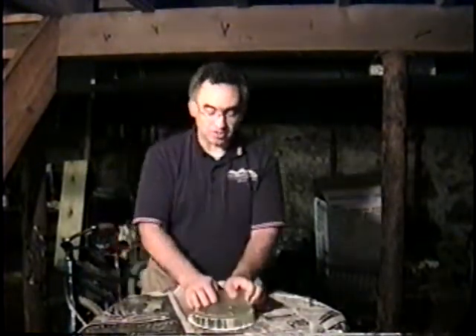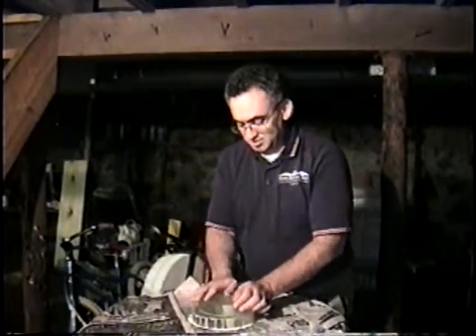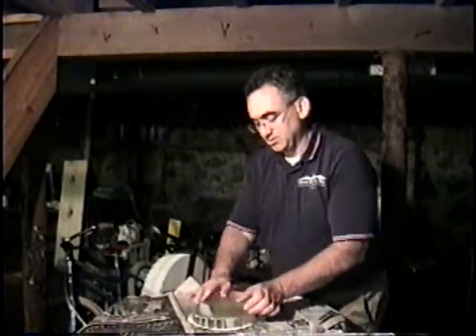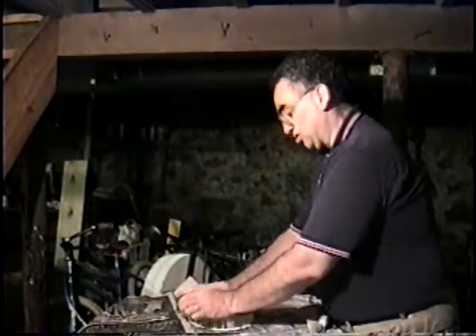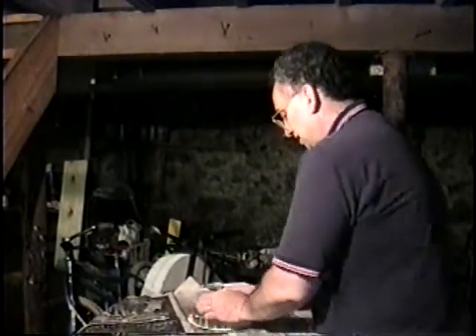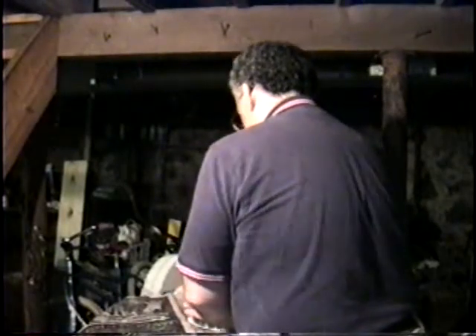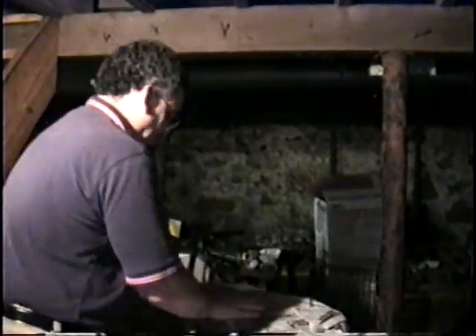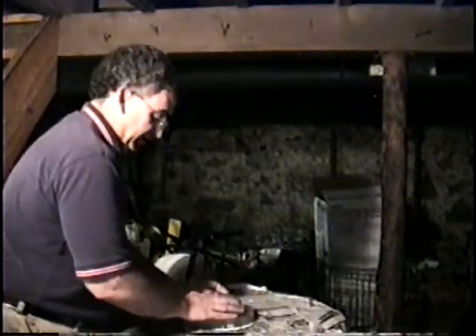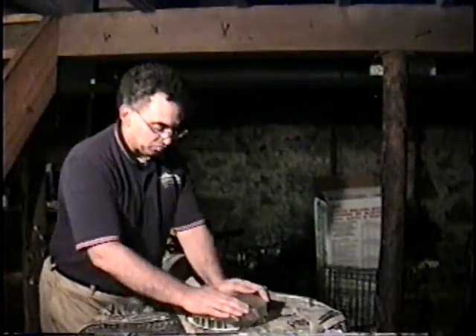I'm going to finish up with the five micron, then go one step further and grind with three micron aluminum oxide to make sure the glass is absolutely flat and smooth with all the pits from larger sizes removed. Then I'll polish it. With six surfaces, polishing could easily take 10 hours per surface — that's 60 hours of polishing. The most grinding I've ever done in a day is about three hours, and generally if I can do an hour in a day I'm doing well. This is going to be a very long project. Once polished, the surfaces have to be figured, and figuring for me doesn't seem to take very long.